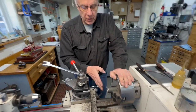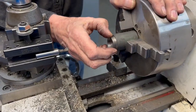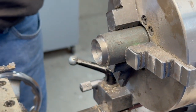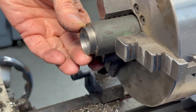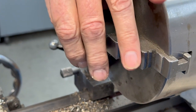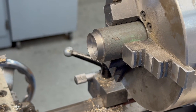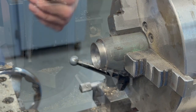I bored out the ID and also bored out the OD, so I'm going to part these off and show you how to slot them and heat treat them. The OD is three thousandths oversized because of the way I cut the rings. I don't break them — I actually cut them with a very fine slitting saw, and you make the diameter a little bit larger to make up for that.